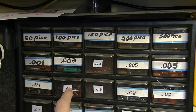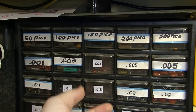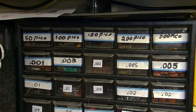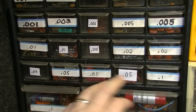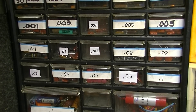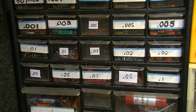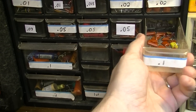Those three values, plus a 0.01. 0.015 is not all that common of a value anymore, but I've got a few old pulls from various things that were still good. 0.02 is a very common capacitor, so you'll want to stock quite a few of those. 0.01 is also very common, so stock a few of those. The more of these you stock, usually the better discount you get through most parts places. 0.05 is also a super common value. Anything above 0.05 or 0.047 is basically the same thing for most purposes — anything above that you're going to use less of, so stock less.